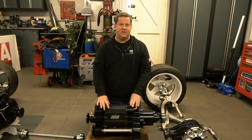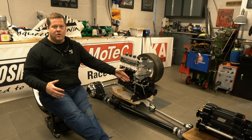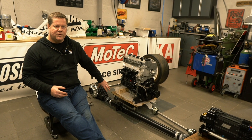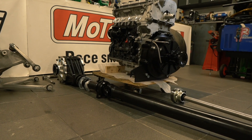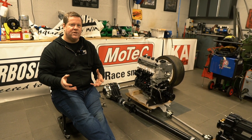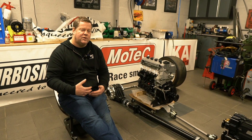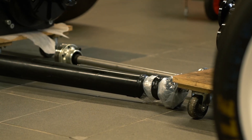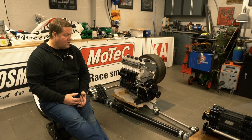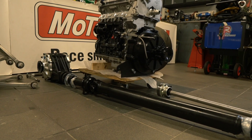This is essentially the passenger side of the vehicle. Along this side, there's the main prop shaft that runs to the rear differential of the car — that's why there's a center bearing in the center of the prop shaft. Inside the car it's so compact and tight that we've had to make a specialized tunnel around the prop shafts for safety reasons, just in case something breaks. That center bearing is there because you can't have a prop shaft too long or it gets a whip in it, and it needs to be large enough to handle the power and torque.